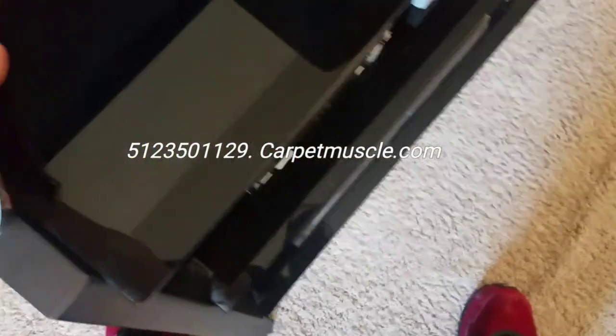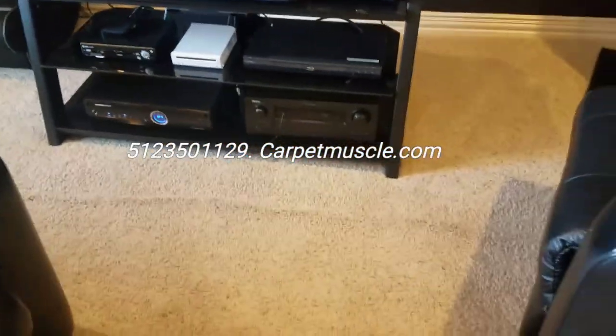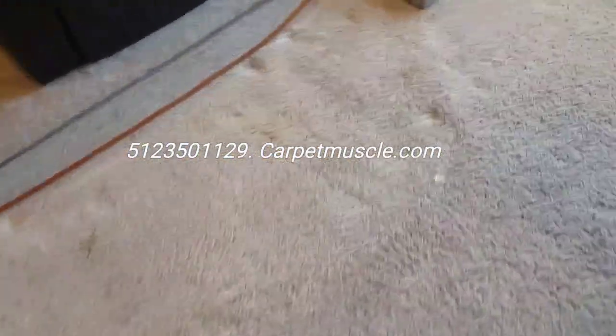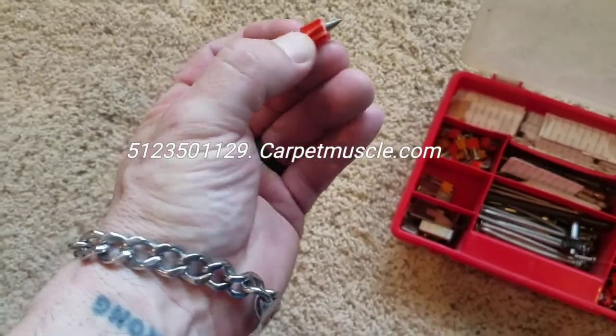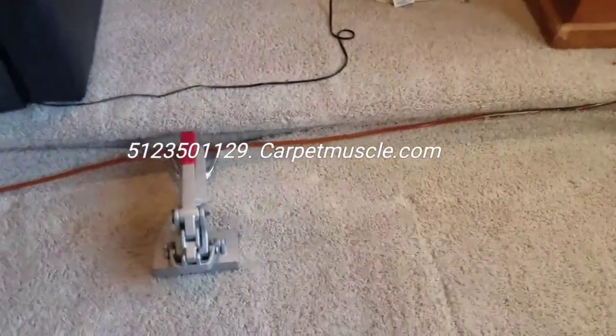Most of the challenge is beyond the furniture here. Luckily these pieces are not that heavy — not that big of a deal. But this one here is the real deal, probably 95 to 100 pounds or so. The tack strip is trying to pull up too, so what I'm having to do is add one-inch concrete nails to it. They tend to hold better — they're an inch long, thicker nails — so they hold better when you're pulling crossways. A little info for you.